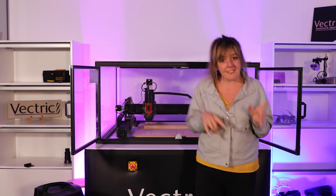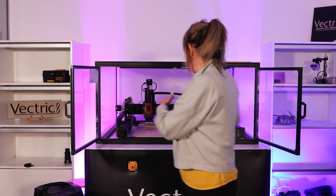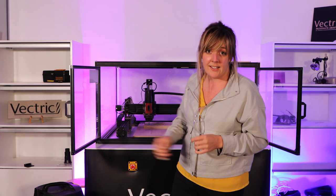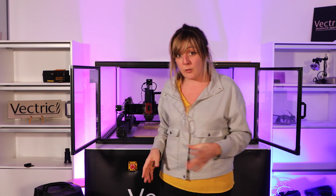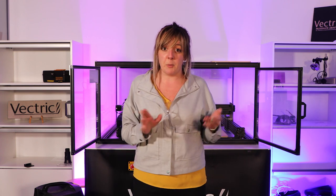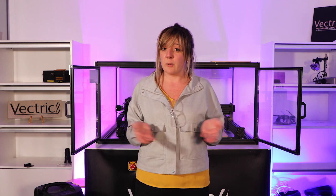And we're back in the labs. So last night we left it where we'd machined the top side. I've left it on the machine bed, but we're actually going to take that off right now. We're just going to reset the X0, Y0 for the machine, and then we can load the toolpaths for the bottom side. And because we're doing it that way, that means everything's going to line up correctly.